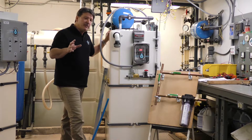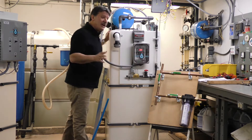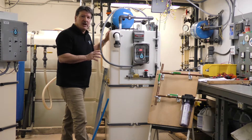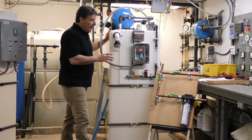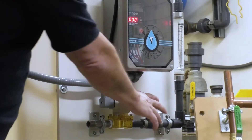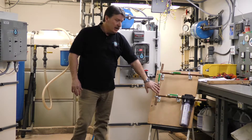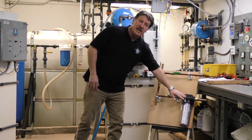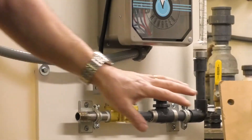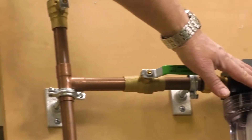With a low-yield well of, hypothetically, about one gallon a minute, I might recommend you set that needle valve for a flow rate of half a gallon a minute — start out very conservative so we don't over-pump your well. That's really what we're trying to do here: never over-pump your well. As you get familiar with collection, water usage, and your well recovery, you can make small adjustments up or down in your collection rate. On the input side, I'd also recommend a bypass and — absolutely necessary — a sediment filter. We need to protect that needle valve from any sediment because the opening of the valve is very small and particles can build up easily to clog it. I recommend a sediment filter with a 5-micron filtration system.